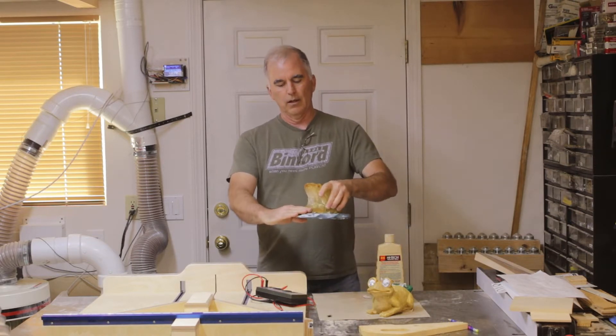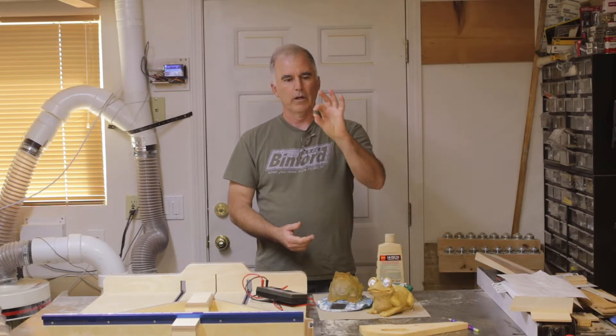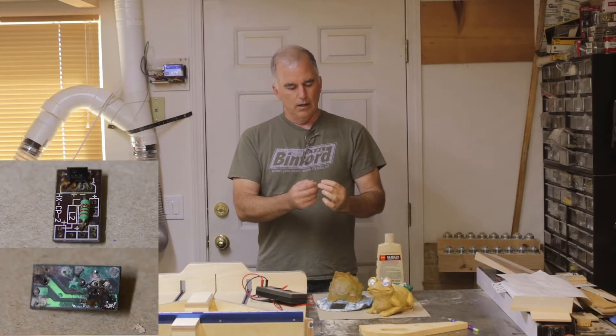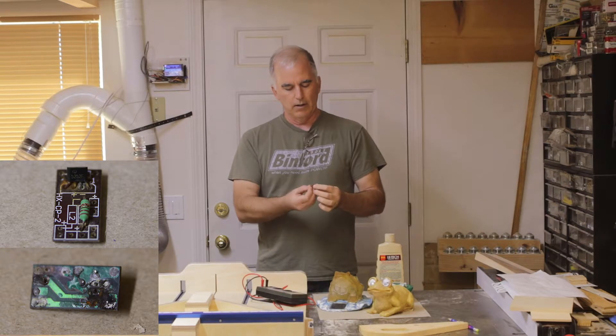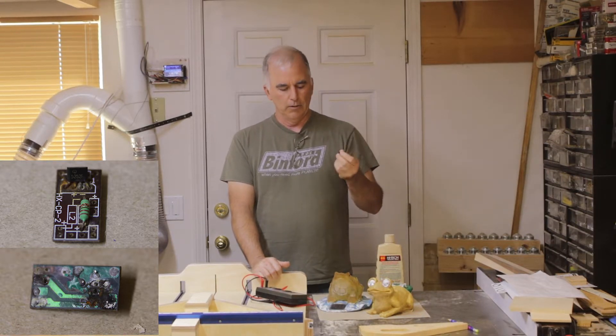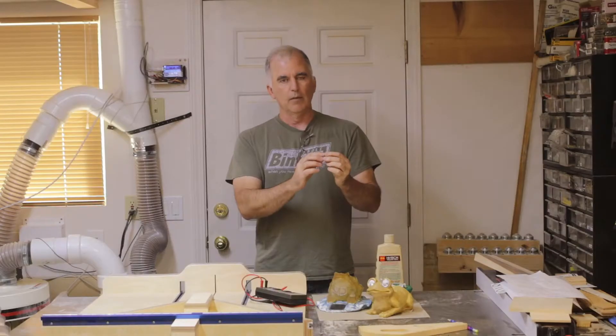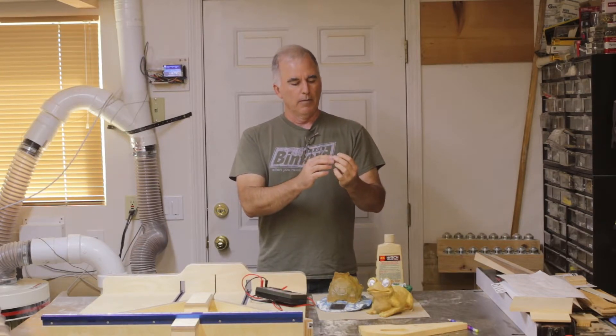All the electronics in every one I have are usually different, though some are similar. This one had severe water damage — it was so rusted there was nothing to repair or solder, it was just rust. So I ended up building a new one, which I won't show today. On a lot of these it will have the same 5252 little 4-pin chip with one inductor that looks like a little resistor. They'll have markings that say things like S+ for solar positive and B+ for battery positive, and L+ for LED positive, with a negative pad.